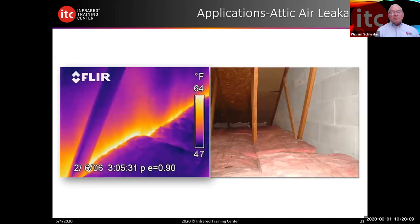Here's a unique image I took quite a few years ago in 2006. I took the IR camera up into the attic of a condominium that was deemed to be very energy efficient. The amount of air infiltration through the attic was pretty substantial — and this was not with a blower door, not with pressurization of the structure. This was just the structure under normal use. Never able to see this with the human eye, but by identifying air exfiltration, you're able to identify a lot of these areas.